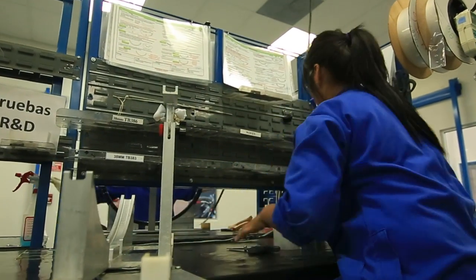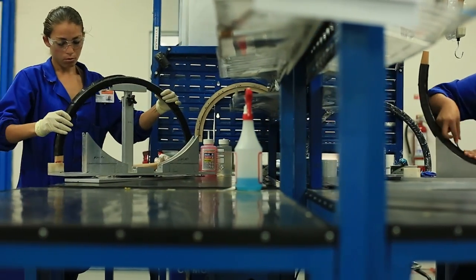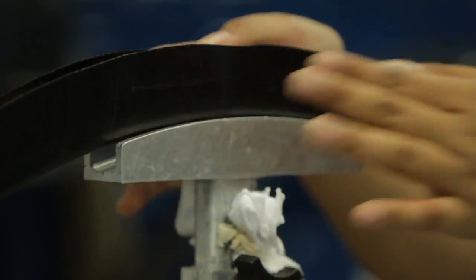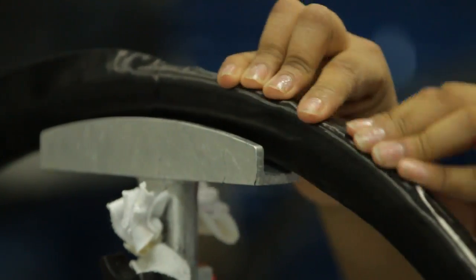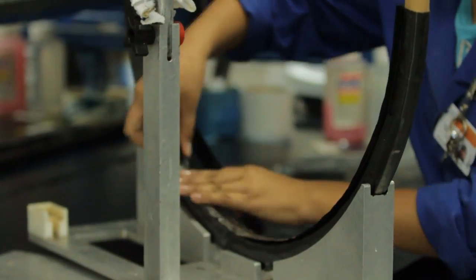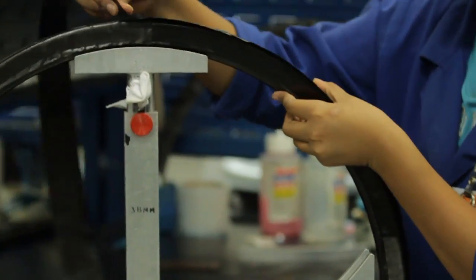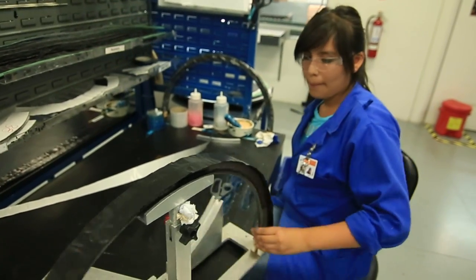At the layup tables there will be two workers, one on each side — one side doing the male side of the rim, the other doing the female side. On the pre-form, they have an aluminum core with latex over it. They take those various laminate pieces cut on the Eastman table and lay them onto that half of the rim, right on top of that latex core. That allows good compaction on the pre-form so there's no fiber movement as you put it into the press — no chance for those plies to shift — so it's nice, net shape.